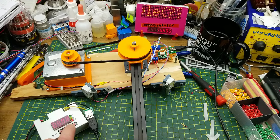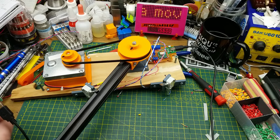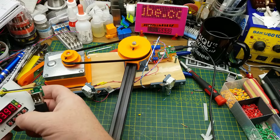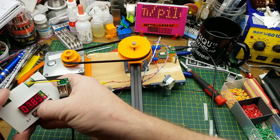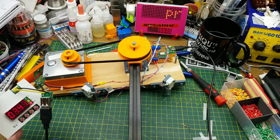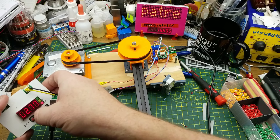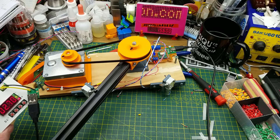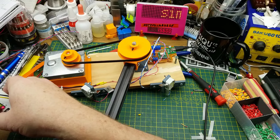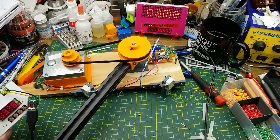I think I'll see if I can slow it down by reducing the voltage. At four volts it is slower and the relay is still doing its thing. Let's try three and a half volts — that's noticeably slower. Should we try three? Two point seven five — no, that's not enough for the relay. The motor keeps working but 3.3 volts seems to be about the limit. I think I'm going to install it, but first I want to manage these cables a little better.